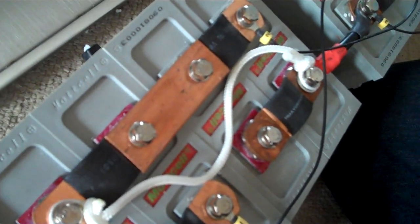I think you were missing some bus bars or battery cables and had a couple of odd little things to deal with too, didn't you? I did have to make my own bus bars, as you can see on the batteries down here. The middle bus bar is the one I had to make. I just grabbed some half-inch copper pipe from the local home improvement store, hammered it flat, and drilled some holes in it.